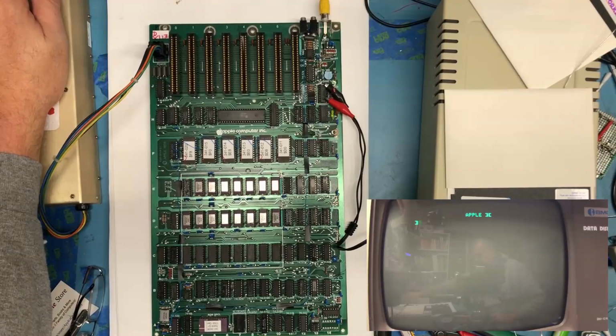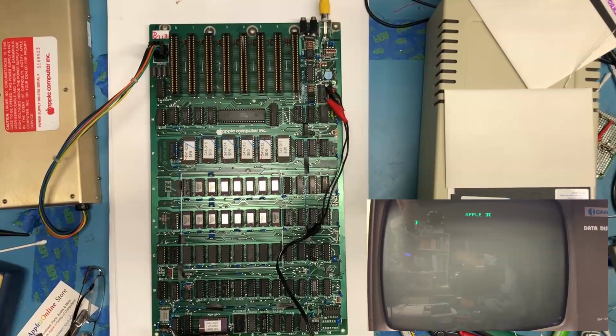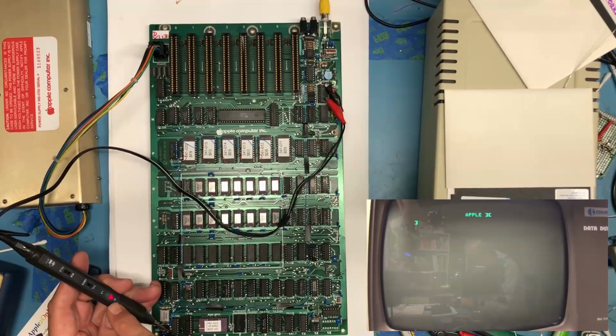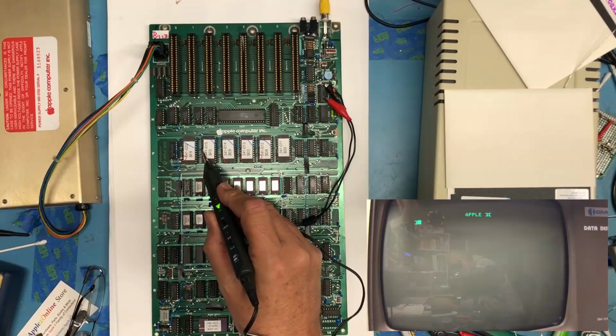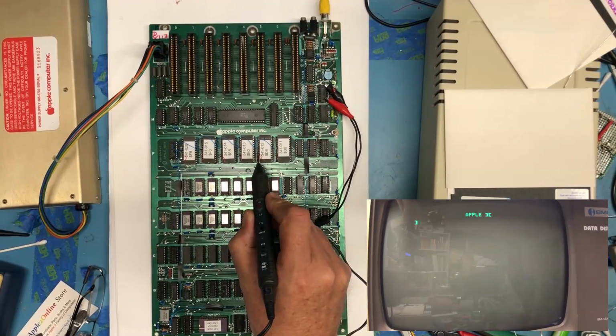So we definitely have evidence then that the EPROMs are active on the system. And of course, if you look at the inhibit line where it comes in, this will show up on camera. See, that's the output. Where the inhibit line comes in, it's being pulled up to a 1. Hopefully, that LED showing up on camera. So the inhibit line that we tapped off is a high, and it's being inverted to a low. And if we get out here on the chip enable on the EPROMs, we'll see that it's low. So that's fully as we expected to see.